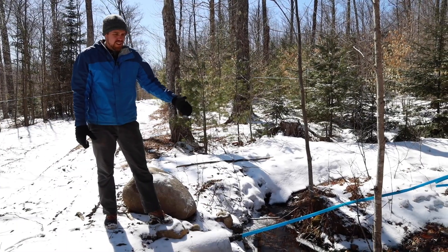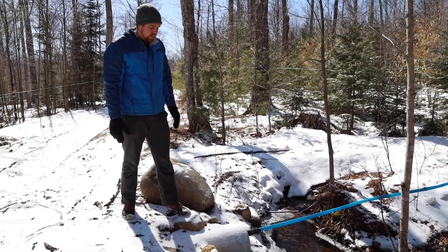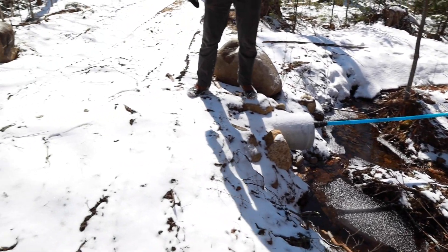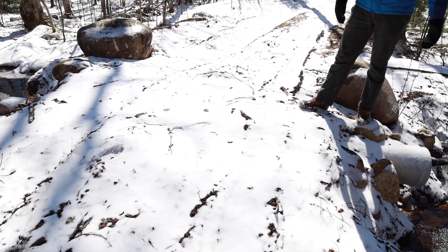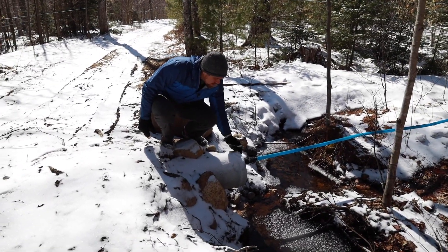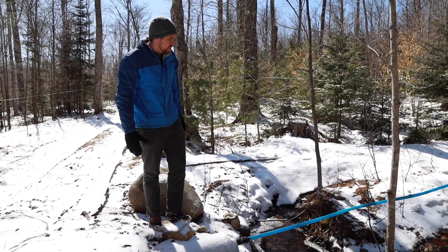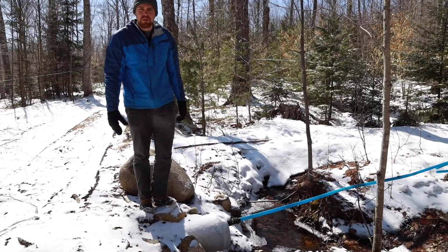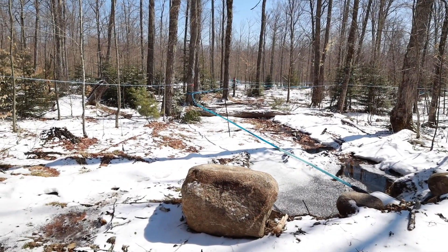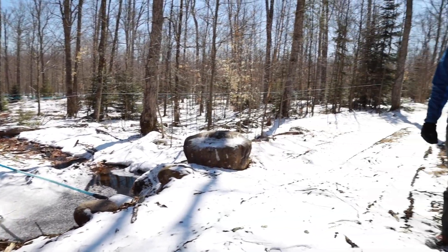Having access through your sugar bush is really important so you can get out there and do work quickly if you need to cut lines. Here we couldn't bring lines up over this road that crosses, so instead we put in culverts that send the line underneath the road. We have a foam insulation wrap around that tubing to protect it so that if it brushes up against the culvert pipe, the colder ground doesn't make the sap line freeze up in there. It allows the sap to flow through and gives us good access. We have a few different culverts across this road so we have access all the way throughout the maple season without having to connect or disconnect lines.